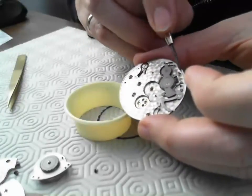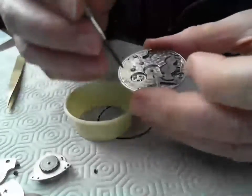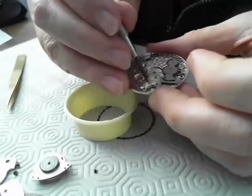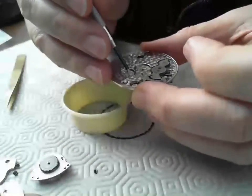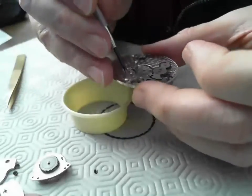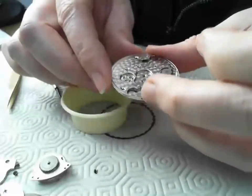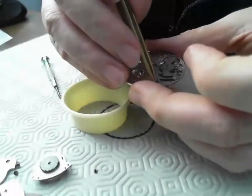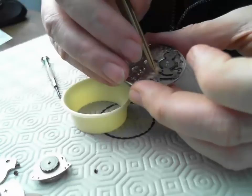If you take that apart, which I've done many times on other pocket watches, you end up having to put the screws back. I usually take close-up pictures of all this so I can make sure everything goes back into the proper place. This little screw here, I'm not sure where this comes from, but there's got to be something here that might have fallen out. This here has got to be here for a reason, so I have to determine what was here. I didn't think anything was there. I'll look at the pictures I took earlier to see if there's something there, but anyway, that is a screw for sure. This here actually might be part of this gear here, so this might actually catch this as it comes up, as a spring or something.